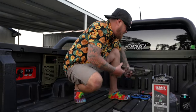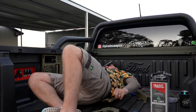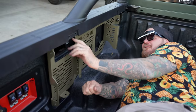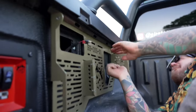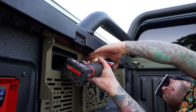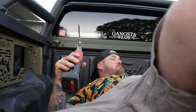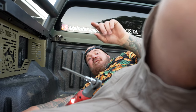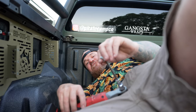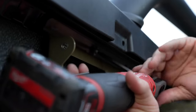What you've got is underneath this lip there's a folded lip up there with a couple of slots. You'll see the slots in there — you can see the thread. Push it back. I'll be honest, I've put a lot of threads in and ruined a lot of threads, so don't do what I just did. Start with your fingers first because this is the best way to cross-thread a bolt. Do as I say, not as I do.